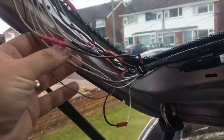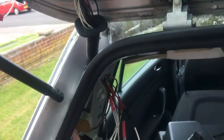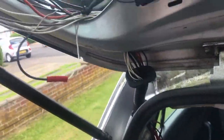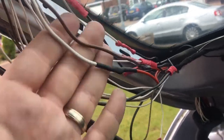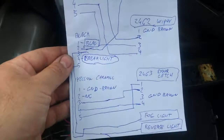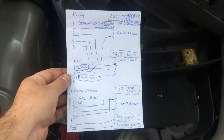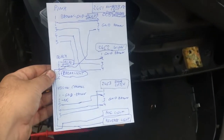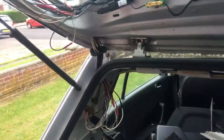What I did again: I cut the wires here, pulled out the broken wires, and fed in some new wires. Start with the easy part — there's one really thick brown and white cable that's easy to find; these are the only two thick wires, all the rest are a lot thinner. I pulled the two new wires through and connected them. The hard part was finding where all the others go. I spent a few hours figuring it out. I've updated a diagram — if you want to pause the video you can see everything where it's connected, and once you connect everything it will all work.